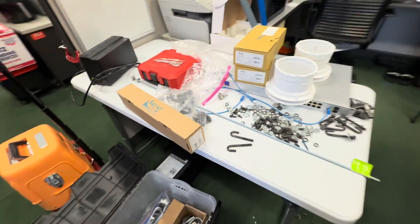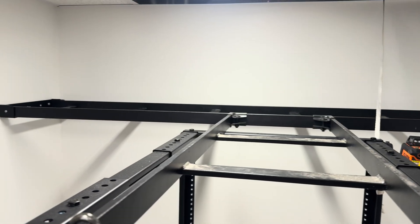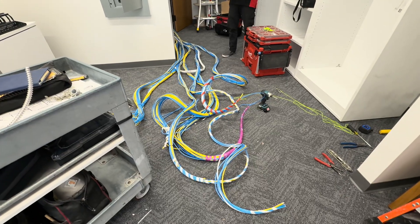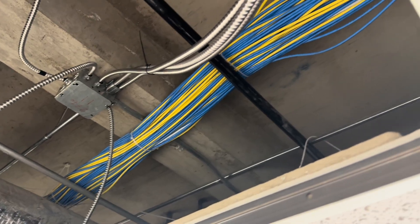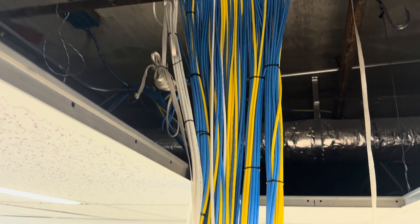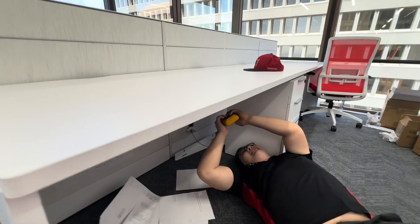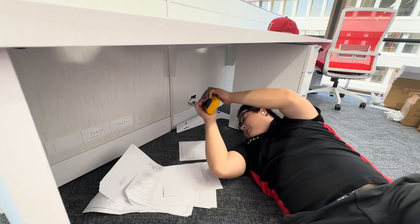The finishing process involves putting up cable ladders and other accessories in the server area, making sure everything has connectors, all faceplates are up, everything is labeled, and everything is tested. We go through the ceiling and dress all of those loose bundles of cable so that they look a lot tighter. The slack from that tightening is brought forward to the faceplates and not backwards towards the server room. When it comes to the furniture, we're usually trying to thread things through the base of the cubicles, or whatever access path the furniture provides.